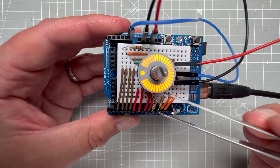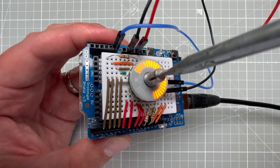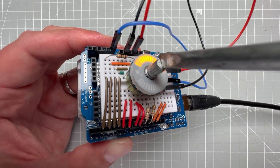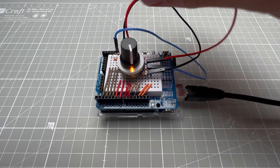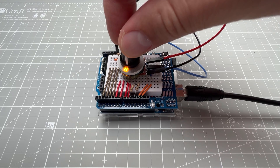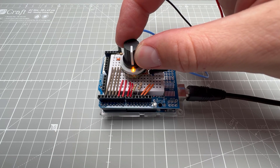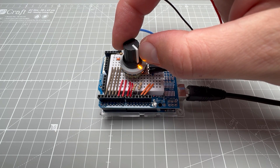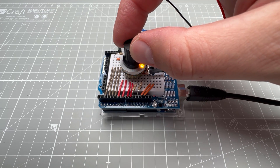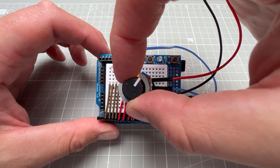Before closing: driving LEDs this way with an Arduino Uno has a serious limitation. Once you add more code to your sketch, the changed timing makes it very hard for the Arduino to keep the LEDs updated consistently. That's why there are dedicated chips designed specifically to drive multiplexed LEDs — we'll cover those next time. If you have any questions or comments, please leave them in the comment section. Thanks for watching and see you soon!